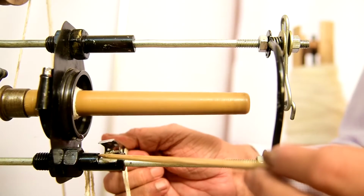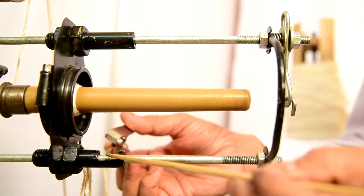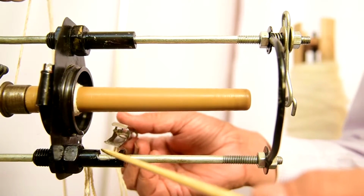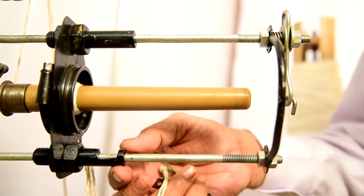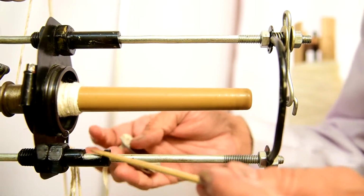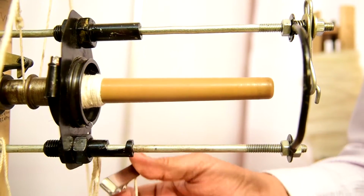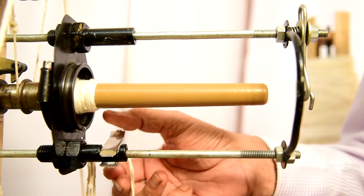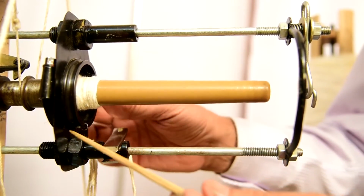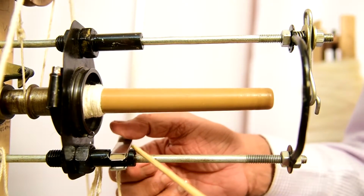And in the lower bushings, we have cut a small depression where this rod is exposed. In this condition, if we leave it as such, during spinning, it gives some sound. So to remove this sound, we have placed a ring clip. The ring clip is inserted in this way, and it will help in keeping the ring tray fixed, and it will remove the sound during spinning.